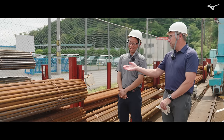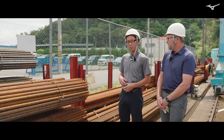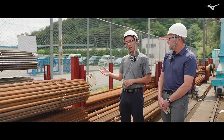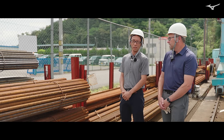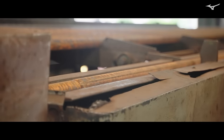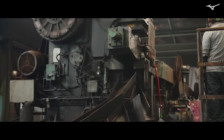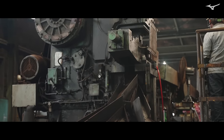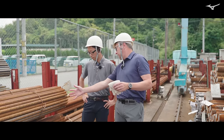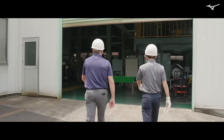They can optimize the metal flow by changing the diameters — smaller diameter for long irons, mid irons, and larger diameter for short irons and pitching wedges. Once these are cut into billets, they're going to be sandblasted perfectly clean. As they go into the primary forging process, they're heated up to 1200 degrees Celsius, where any impurities just melt right off. Each rod can produce approximately 50 golf club heads, and these come in bundles of 80, so each bundle is roughly 4,000 golf club heads. Inside the factory, they can make about 4,000 to 5,000 heads per day.